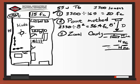We don't have those, we're just going to use the HRC is the one that we're going to be using. So again, we're going to need to look at some of the different factors that we need for this. So one of them that we need is our coefficient of utilization. Okay, we'll get that. Then we also need to figure out our light loss factor. So we'll get into a chart, look at that, and we need to figure out our room surface dirt depreciation over time as well. So we'll be looking to those as we figure this calculation. So a lot more builds into this one. So let's take a look at what we've got.